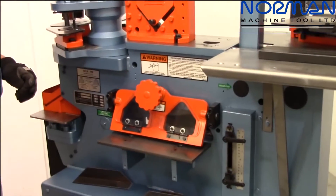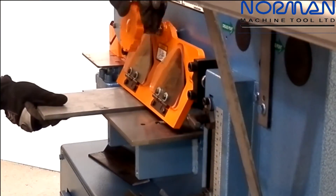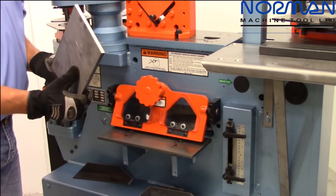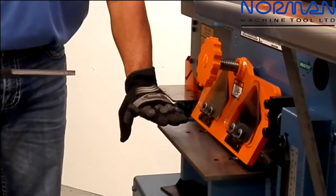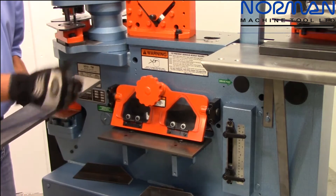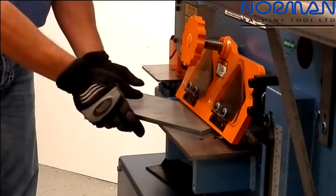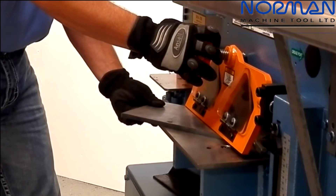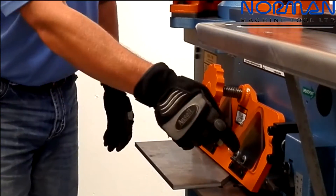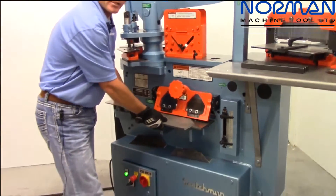Down to our flat bar shear — we have a 14-inch flat bar shear, which is good for 3/4 by 4 out to 1/4 by 14. This is a 3/8 by 6 plate — cuts it with no problem. Keep in mind you can get an optional shearing table with a squaring arm and jigs for 45 left and 45 right. We also have back gauges for these machines if you're making a bunch of the same plates. The nice feature with the electric stroke control is it's so easy to set your stroke just above and just below your material, maximizing your time and increasing efficiency.